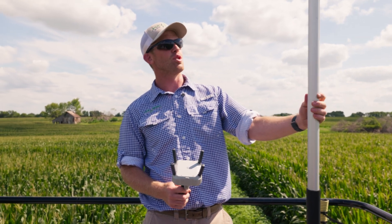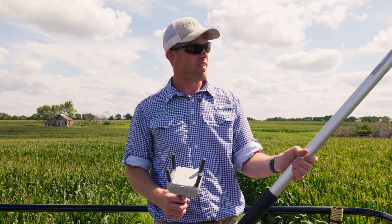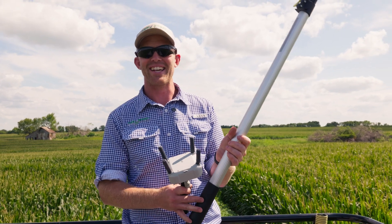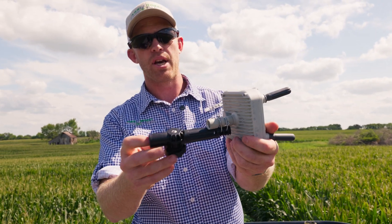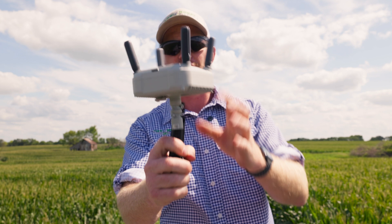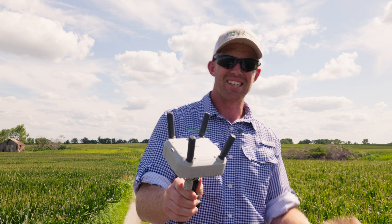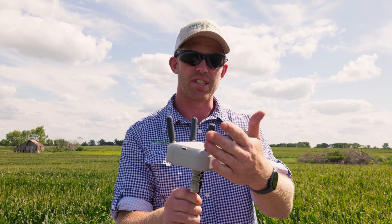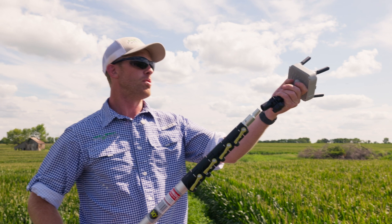What we've done is we get a 36-foot or 30-foot tall painter's pole from Amazon. There are a number of different styles out there — don't cheap out, get one that's decent quality. We get an end that screws onto the top and we zip tie, or in this case wire, our relay station to it. That way we can remove it so it's not always on top of the pole, because these antennas tend to break off if you hit them against something. Make sure you remove your relay station whenever you are taking your pole down. Put it onto the pole.